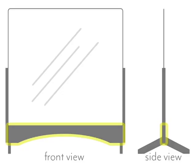The length of the bottom support should be the width of the acrylic sheet minus half an inch. This makes it so that there is just a little bit of wiggle room between the two sides after installing the acrylic sheet. You'll notice that I put an arch on the bottom of the bottom support. Not only does this add a decorative element, but it's functional because it opens space to pass items underneath the barrier when in use.